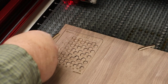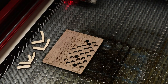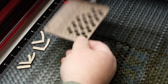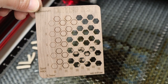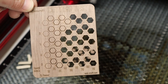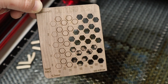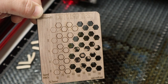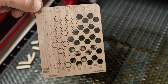In real life that took about eight minutes to run — definitely not as long as nine minutes — so this is not a very long job. As we can see, we were successful at least with our cutout on the profile. If I pick the board up and give it a few light taps — I don't like to beat the devil out of it, as Bob Ross would say — I want to know what realistic fall-through cuts look like on this machine with this material. Looking at it, the engraving setting could stand to be a little bit darker for nice-looking results on camera, but in real life I can still read it and I know the settings. Running it at 200 mm per second, 80% power — maybe slowing down to 150 mm per second at 80% would be fine, but it's still usable.